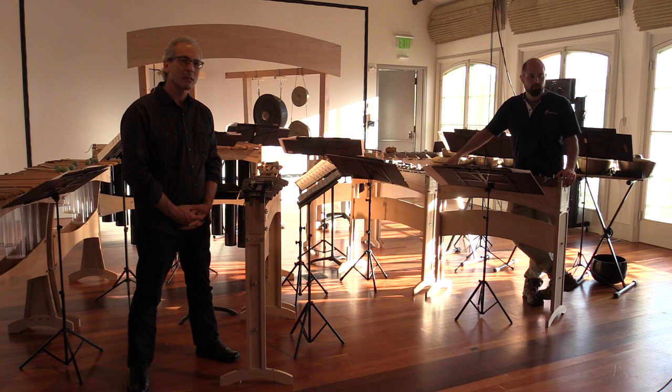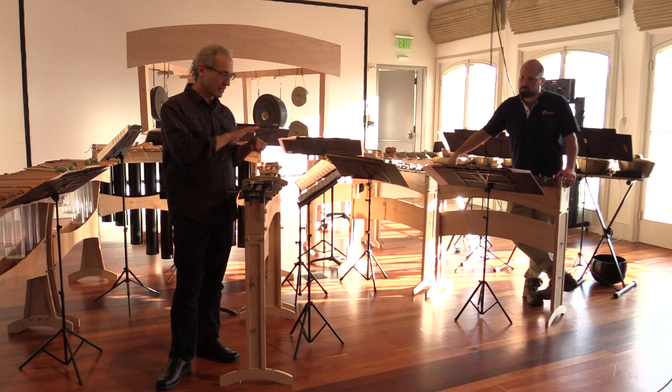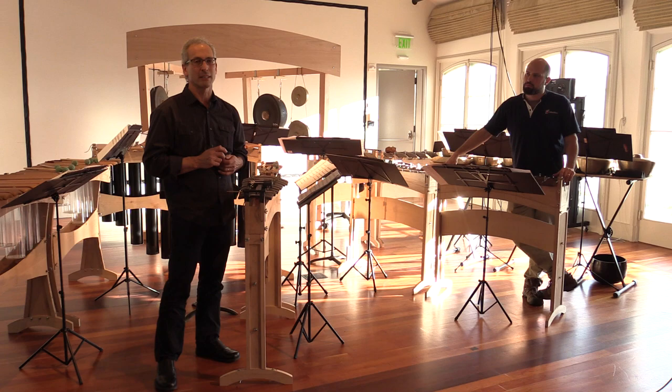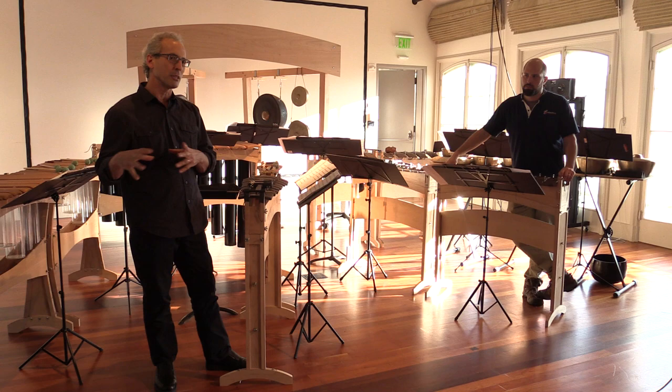There's no tuning in the sense you mean at all until they quench it. And then they hear the sound, and then they polish it. And then during the polishing process, they start actually tuning it. I see. And what do they do to tune it? They cold hammer it. And the scraping, of course, changes it, so they do those two processes together.